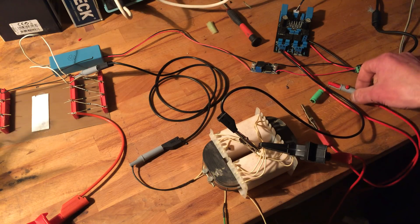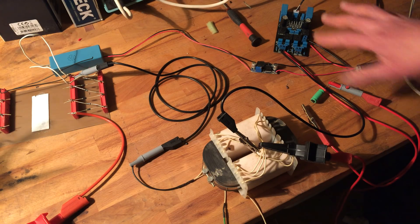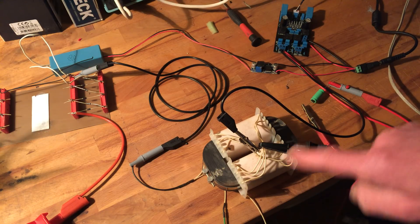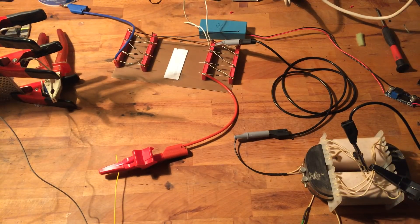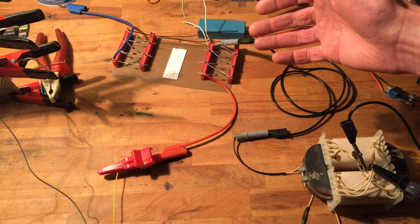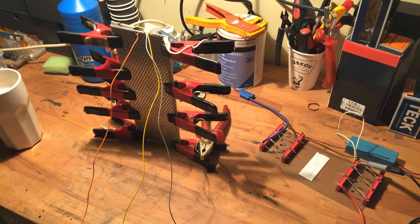And I added a small cap in between, because it's not gonna play low end, so I might as well not give it to him. Then on the class D amp I've got my phone. It doesn't play really low, and there are several reasons why. First of all, my phone doesn't output enough voltage to use the amplifier to the max. Also, this is a class D amplifier and it probably doesn't like the transformer very much. Then the high voltage — I can't crank it up more than this because it tends to flash over to the uninsulated stators. And if I drive it too hard with the transformer it will flash as well. So that's the reason why you would normally insulate them.